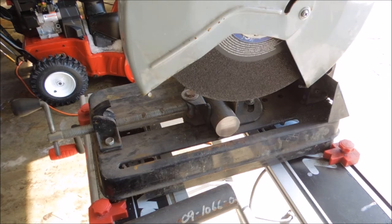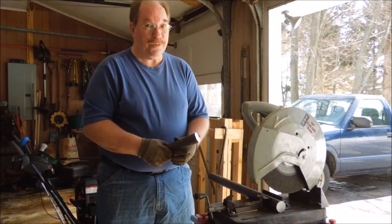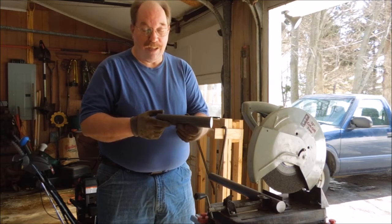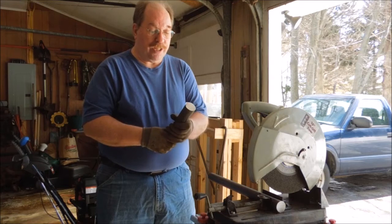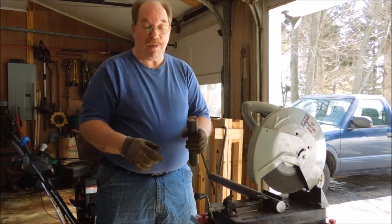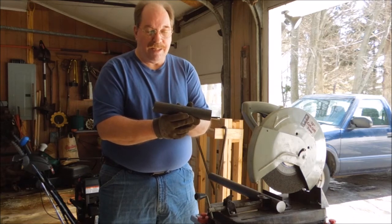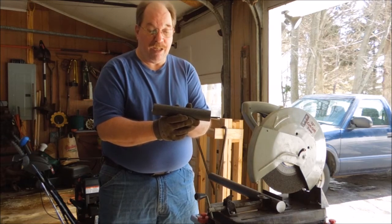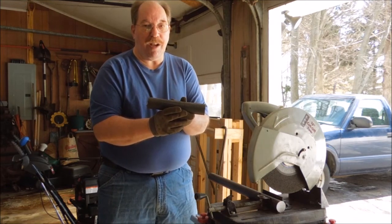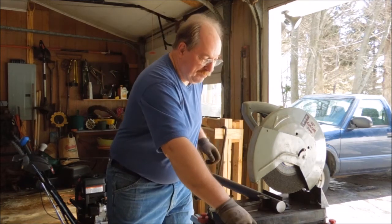The reason I had problems cutting the plate was that I was using the wrong tool. Now that the piece of bar stock is cut off, I've got to put away all the tools so I can get the garage clear for my wife to pull in. But then I'm going to set up the piece of bar stock in the chuck and use the steady rest to hold it while I face off this end and drill it for a center. Then I'm going to flip it around, face off the other end, and drill it for a center so that I can turn this between two centers. That's the easiest way to make sure everything's concentric — putting it between centers is automatic, whereas chucking it means you have to recenter it every time.